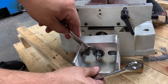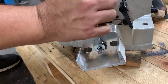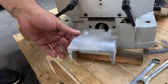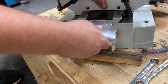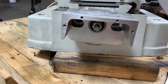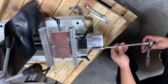We found out that because these machines come with a little toolbox with wrenches, you can use one of those wrenches so you don't screw up your good set. You can grind one of those down a little bit thinner so it will fit in between the jam nuts to do all of this. Now we've slid it back and we're going to screw it into the base.